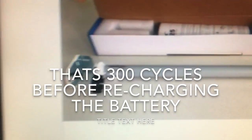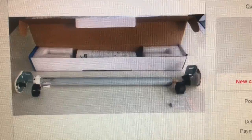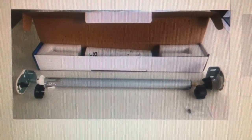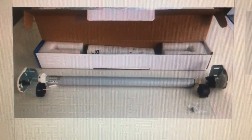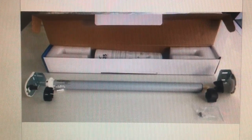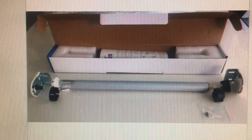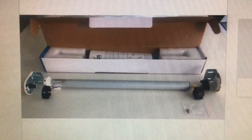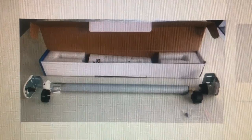The pack includes the end bracket, the crown to go with it, the other end bracket, as well as the roller and hardware for a basic setup. They can be retrofitted to an existing roller blind. I don't supply the actual aluminium roller blind itself — this is just the insert — but it works very well and fits many different sorts of roller blind types. You can do some minor modifications on the crown piece if needed. The roller blind aluminium shell should have a 36 to 38 millimetre inside diameter.